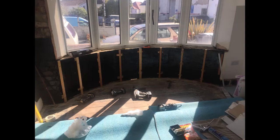At the ends of the walls I used bonding coat plaster, then finishing coat plaster, and blended the two sections with a bit of fine filler. I was quite happy with the final result. For the skirting board I ended up using a plastic OG skirting which worked really well — being plastic it was easy to get it around the bend of the bay window. Not perfect, but certainly good enough for a rental property.